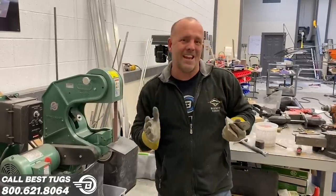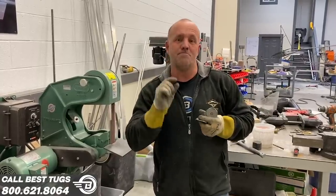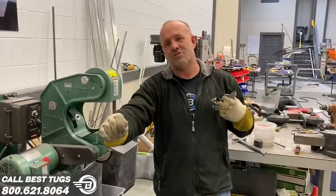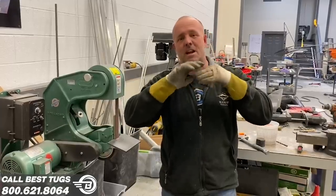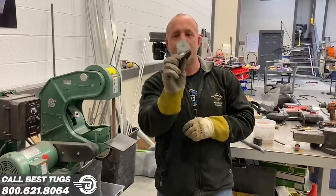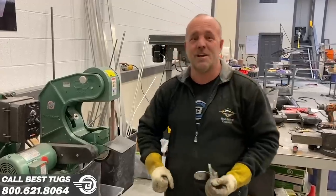But while I'm at it, I'm changing out all the pulleys in the whole airplane. Instead of a bushing, I'm going to ball bearing pulleys throughout so I can tighten up those cables nice and tight, and when I move them I won't feel that slide of a bushing bearing, but an actual ball bearing on all the pulleys. So it should turn out really good, but here's one. We got several to go, so let's reroute a bunch of cables and get this plane done.